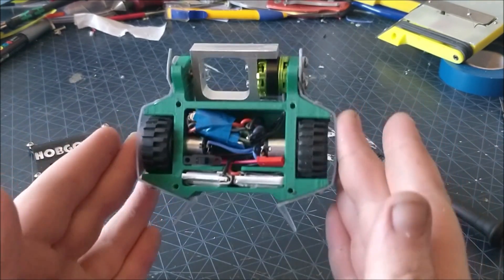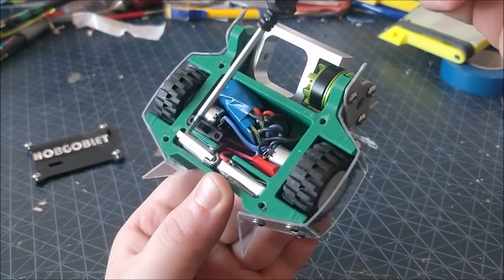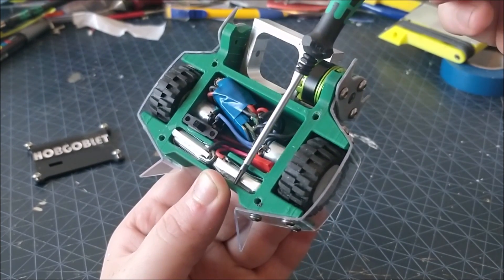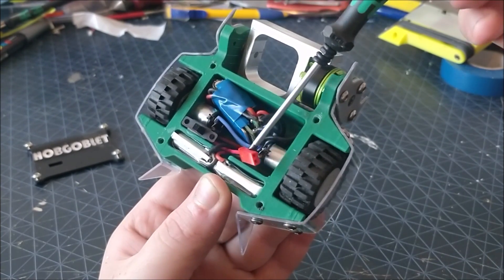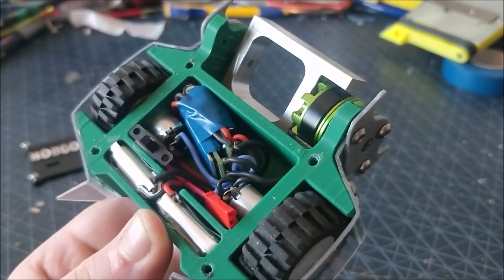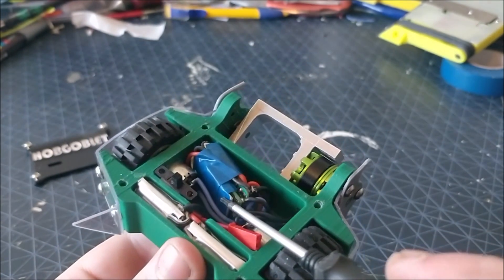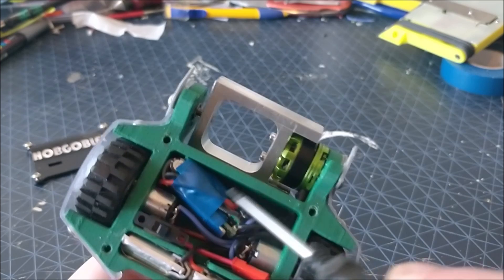As you can see, this is quite a small robot, even for an Antweight, and so it's pretty cramped inside. There are 250mAh lithium cells out the back with a charge port and switch, and the drive is two N20s. That mass of blue tape hides a Malenki Nano and an unnamed brushless ESC.